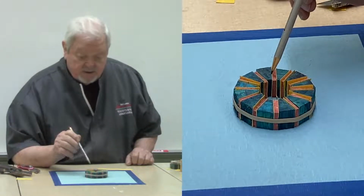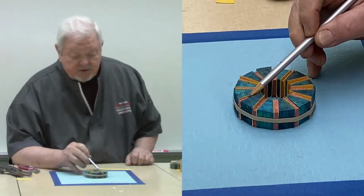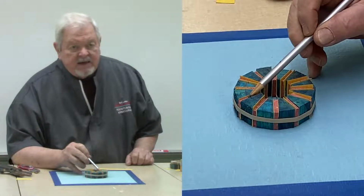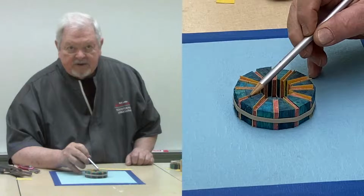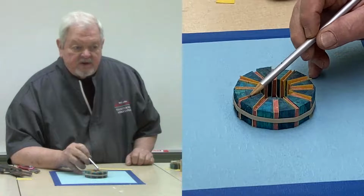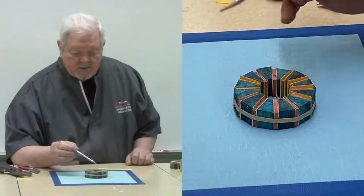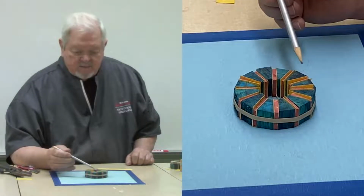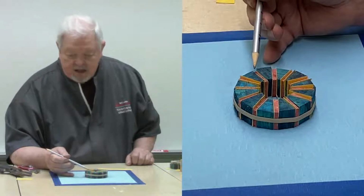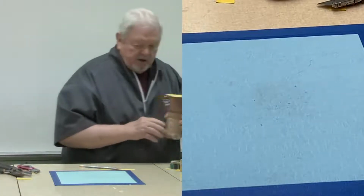Now in the next video, I'm going to show you the sled I used to cut these spacers, because these are about 1/8 of an inch, and the difficulty on cutting with a table saw 1/8 of an inch and up is occasionally one may go flying and you'll have to go trace it down. But if you cut them narrower than that and thinner, then you may need some special ways of holding it. And I'll show you a little video clip in the next film about how I cut my spacers down to under 50 thousandths.